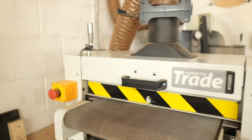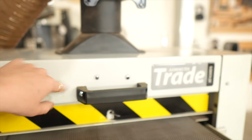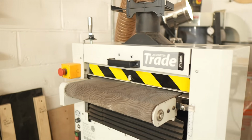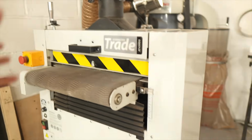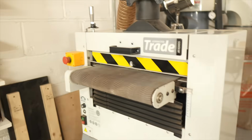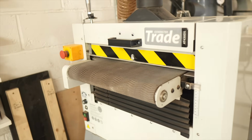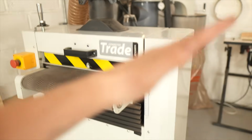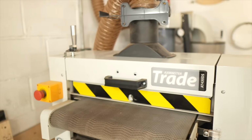Now, I do a lot of work with this guy, so of course we had to make him have a personality. Doesn't have a name yet, but that's okay. This one I've been really impressed with because during my apprenticeship I used a jet sander, and it had one motor on one side and not one on the other side. So the motor would spin on one side and sacrifice the other end in power. What you ended up with was timber that was slightly on the piss, as they say. This guy, absolutely not.